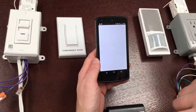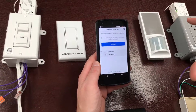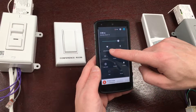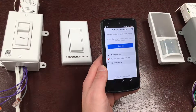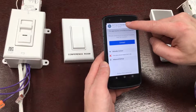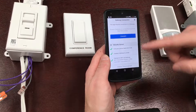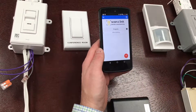I've downloaded that already, so I'll go ahead and open it. There are different ways to connect. Most versions of Android you can press the connect button and it will take care of all the setup. This is an Android Nexus and it requires an extra step — I have to manually choose the Scan and Link gateway from the Wi-Fi settings, then wait for a message saying it can't get to the internet. I need to quickly choose to stay connected to the Scan and Link gateway. The phone uses Wi-Fi to communicate with the gateway, and the gateway controls the devices. Once the connection is done, the screen goes away automatically.